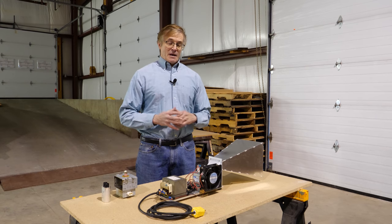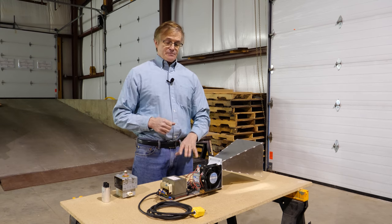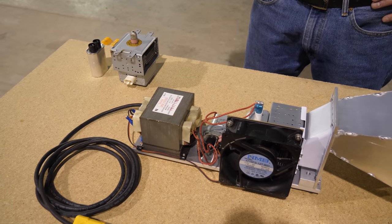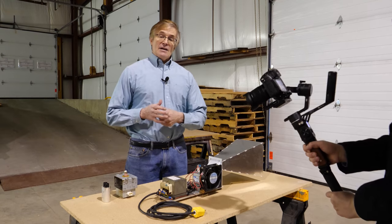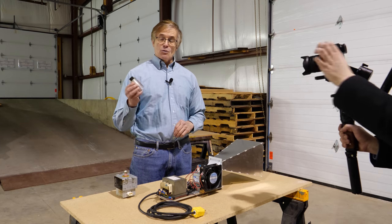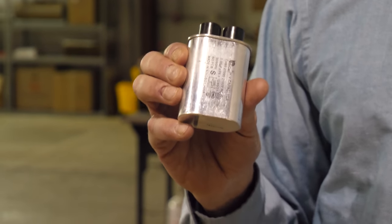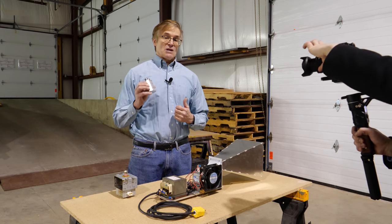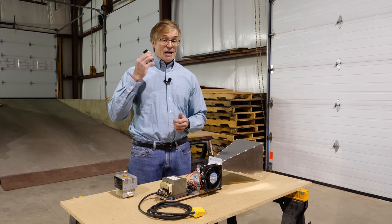But even though microwaves in high energies are dangerous, the voltages used to drive the machine are potentially deadly. There are many areas of this device where you could easily contact over 4,000 volts at relatively high currents. They can be deadly. And in addition to that, there is a capacitor inside of there that will store energy so that even after you've unplugged the unit, it will retain a dangerous level of charge for some time. Now, the capacitor used in microwave ovens is a little unusual in that it includes an internal dump resistor, effectively converting that high voltage charge into heat, rendering this thing safe within a few tens of seconds and certainly less than a minute. But that is the exception, not the rule. Most high voltage capacitors do not have that feature and can retain deadly levels of electrical charge for long periods of time. You gotta be careful.